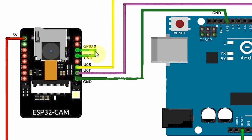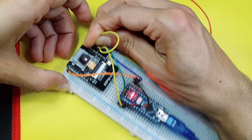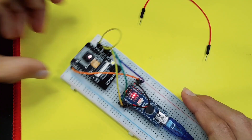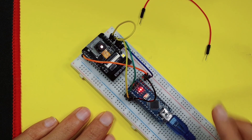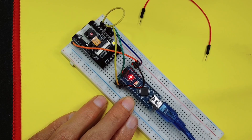That's really important to upload the code. And to make sure that the Arduino is running and never resets, we have to connect the reset pin of the Arduino to the ground using another jumper wire. You can pause the video. For me, I have connected all of the pins using the breadboard. Now we are going to connect the USB cable so that we can upload the code to the ESP32 camera.